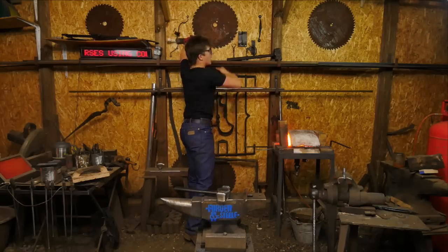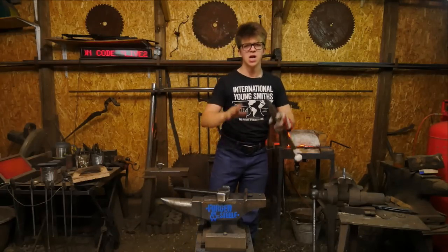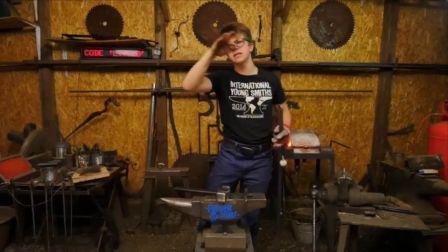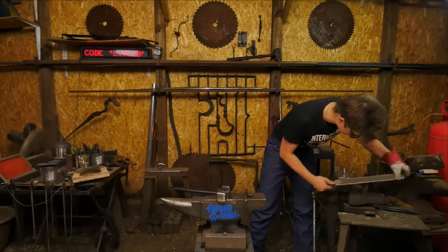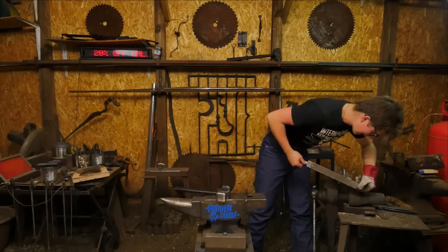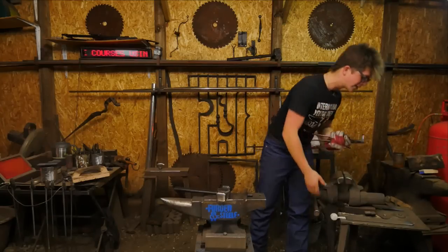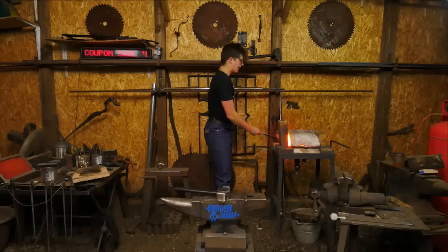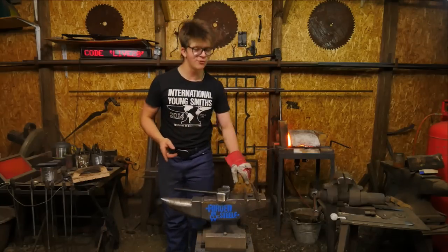It shoots the flame around and creates that turbulence inside the forge so that you further dissipate the flame, create more of an even heat. And it means that that flame takes a little more time getting to the steel. My theory from a layman's perspective is that the flame contacts the steel in a less oxidizing part of the flame. It's more of a neutral part of the flame, and so you can mitigate against overly oxidizing the material by making sure that you travel the flame as long a distance as possible before you hit the steel.